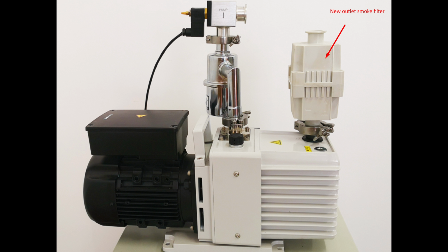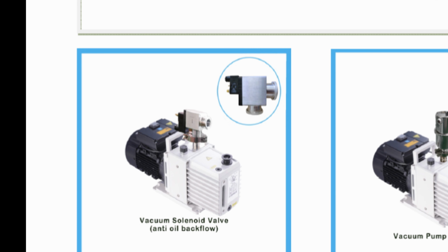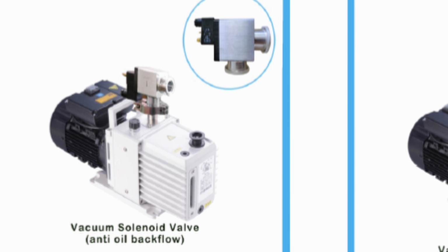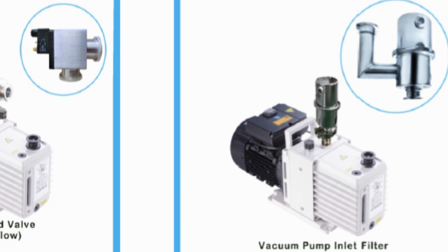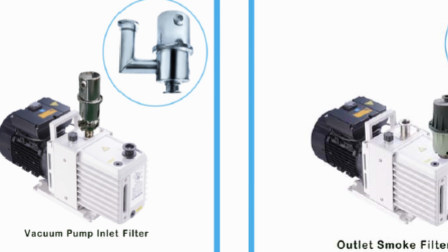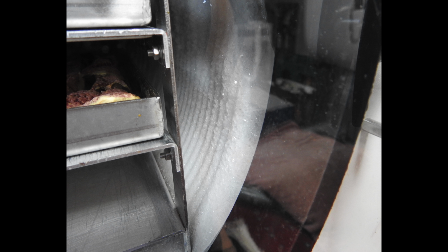If you generally run your freeze dryer automatic, you may not be able to really utilize the solenoid valve, because technically the automatic programs of the freeze dryer detect the amount of vacuum, and from that they change the amount of heating to the shelves. And if you switch off the pump in the drying process, and that's what I'm doing here, this will confuse the automatic drying process. So currently there's no automatic process that supports the solenoid valve, and hopefully they will do something in the future.